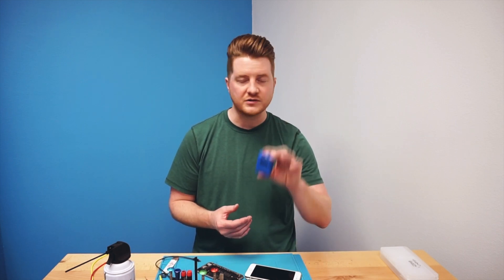One of the things to keep in mind is to use multiple ways to diagnose and test your devices. We always really like to use the Smart Mod Pro TriStar tester on all devices that come into the store — it's a convenient way to know if they have underlying board issues upon check-in. If they do read bad, we use a multimeter to confirm the results and see if they match up with what the Smart Mod Pro told us.